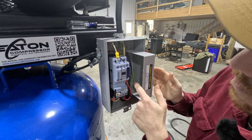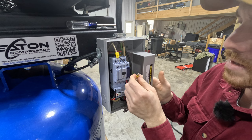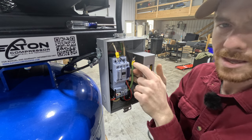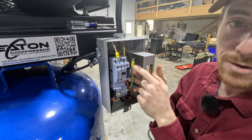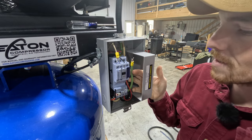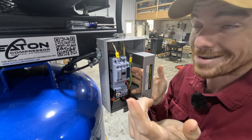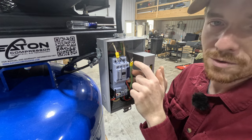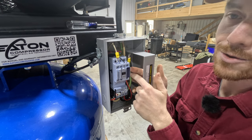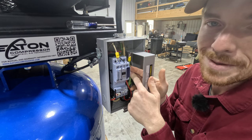But in my case it's not solid wire — I have stranded. They have little connections on them, but the problem is these ferrule connectors are typically for 10 to 12 gauge wire. Mine are six, so it's a lot bigger. I'm going to see if I can find something more official. You could probably tin the ends. I'm sure just putting the strands in and clamping it down would probably be fine, but I like to do things more official. I'll be back when I figure that out.